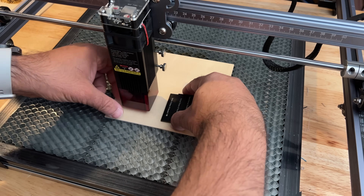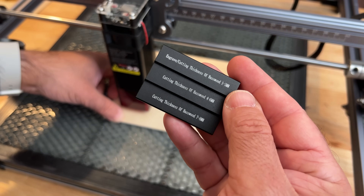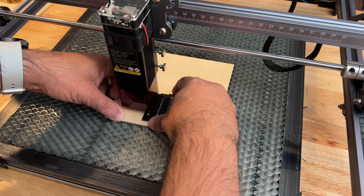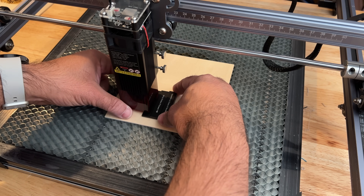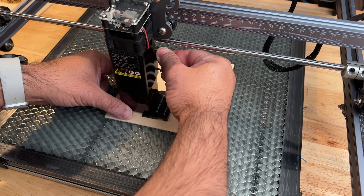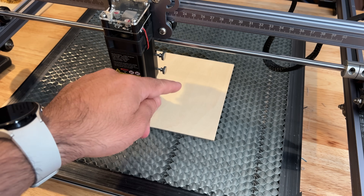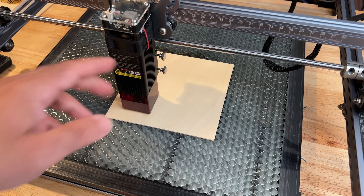The first thing we're going to do is make sure we have the right focus. You can see the thickness of my material — it has each one of the material thicknesses if you want to do a cut. So we just loosen this side, the laser drops down, it rests right on the piece, then tighten each one of these hand-tight and remove it — it's going to stay in place. Next we're going to go into Lightburn. We're going to set a cut and then an engrave — actually, we're going to engrave first, and then do the cut.